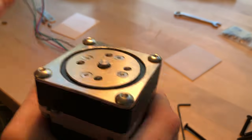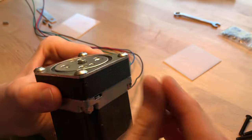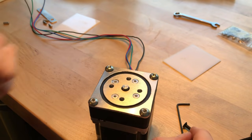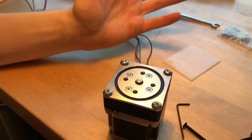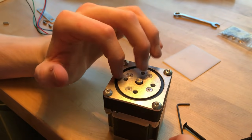You can hear that it's just the littlest bit crunchy. I think that's from the pins kind of rolling around in their oversized holes. But it's not too bad in that regard. The bigger issue though is with the output rotation speed. In an ideal cycloidal drive, the output rotation will be continuous, as with any gearbox. I don't think I'm quite getting that with this one though.